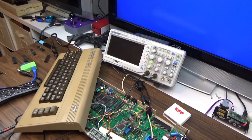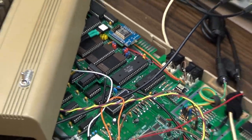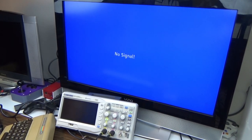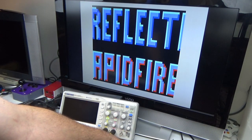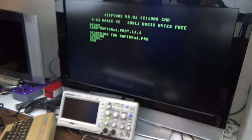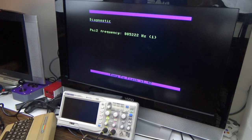For the sake of control and completeness, here we are with a genuine 6510 in there — just to show you this machine really does work right. In NTSC mode with the Kung Fu Flash, it fires right up, loads a demo, diagnostic fires up no problem, frequency is bang on. Kicked over to PAL mode — fires right up too. This machine and the Kung Fu Flash are absolutely rock solid with a real 6510 in here.